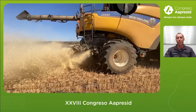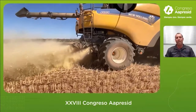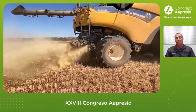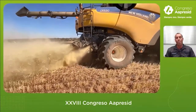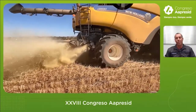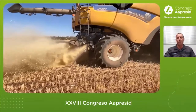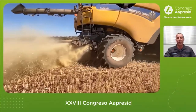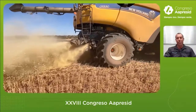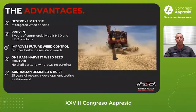As you can see here, there's a lot of chaff and dust that comes out. It's being processed and it mixes in with the straw that's going through the chopper. So as you can see in this picture, we incorporate that back into the soil, eliminating any need for chaff burning and chaff lining. This is an integrated, neat little package on the back of the machine that kills 98% of the weeds that come off the sieves and through the chaff. It kills all of those.